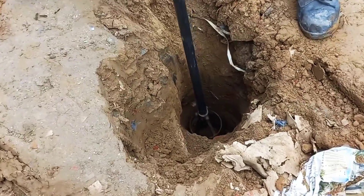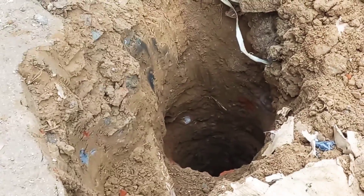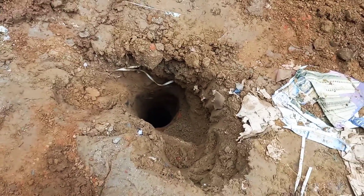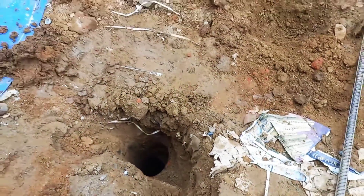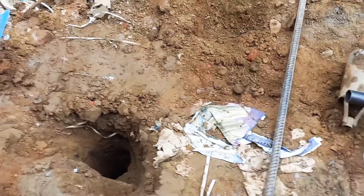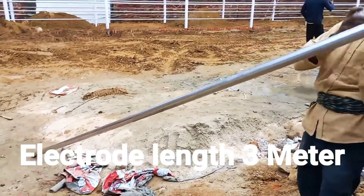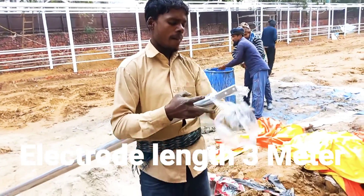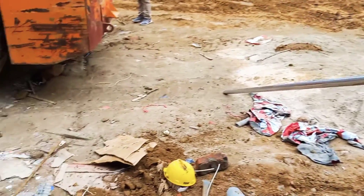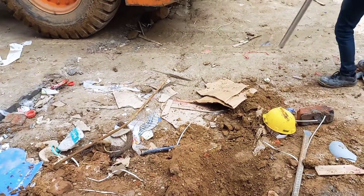In the rest of the area other than the electrode, chemical will be filled. In chemical earthing, the electrode we use has chemical inside it as well, and we also put chemical outside of it. Now the person feels the hole is deep enough for the electrode. This is a three-meter-long GI — galvanized iron — electrode. There is no rocket science in putting the electrode into this hole.